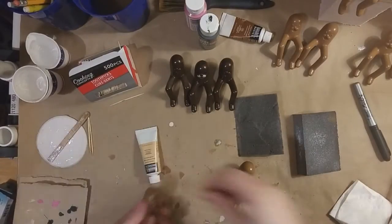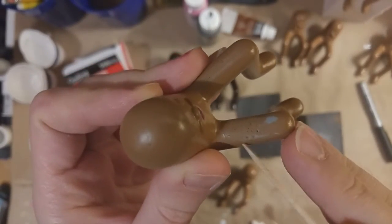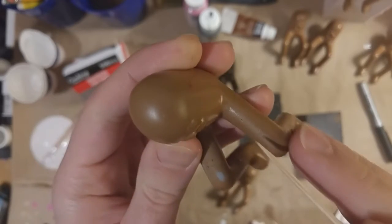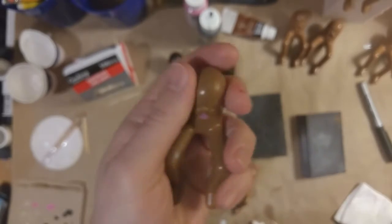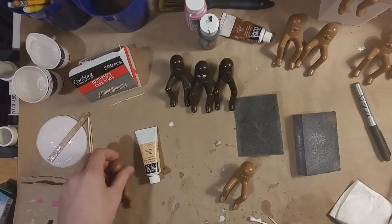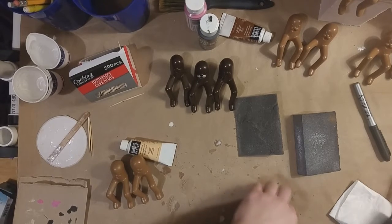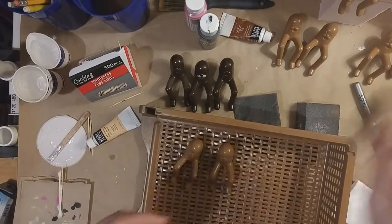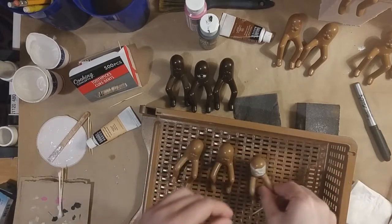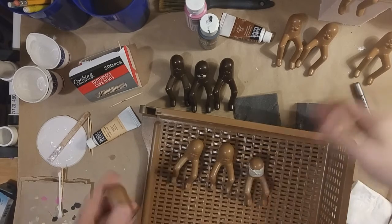Unfortunately there were problems, as I foreshadowed. Everything seemed alright until I took a good look at some of them and noticed dark pockmark air bubble sorts of deals on the legs of several of the gondolas. That meant I needed to sand them smooth and repaint them, but for whatever reason when I went to spray, the paint wouldn't naturally fill in those tiny gaps like it should.